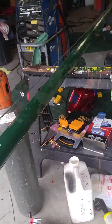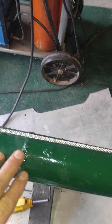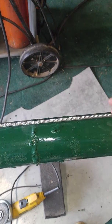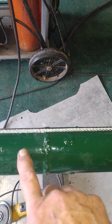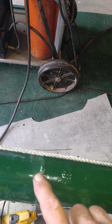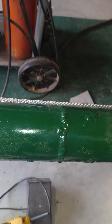Sorry about the camera work — one man band. EMT is galvanized pipe, and what I did is I welded it with suitable precautions. I used a TIG welder — tungsten inert gas — and I welded it so that all the pipes fit inside each other. Each section of pipe I took and cut a one-foot section, split it down the middle so it was smaller, and then stuffed it inside. So inside this 2½-inch piece of EMT is another piece of 2½-inch EMT cut longitudinally and collapsed so it would fit inside and make a sleeve. I then welded this together and plug-welded it in three points on each side so that the sleeve was anchored to the pipe and the joint here wasn't going to carry all the stress.